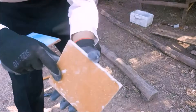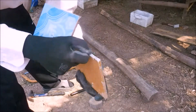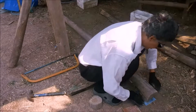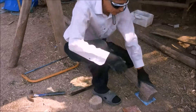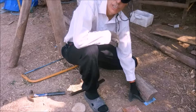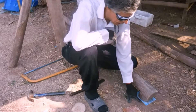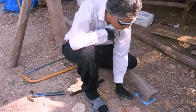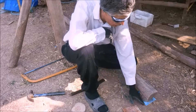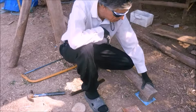You can see that's a piece of weather board I'm talking about. I don't think termites are going to eat fiber cement. Put it straight underneath — that's going to stop termites. Termites will have to bridge it with a clay tunnel, and that's what you can see. You're not going to stop termites, but if you just inspect your floor every now and then, if you see the clay tunnels coming around you can clean them away. And if you want to spray, you can spray. At least I've now got a nice inspection point where I can see termites coming up to my wooden floor.